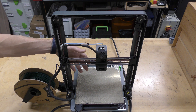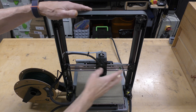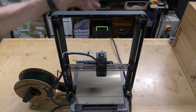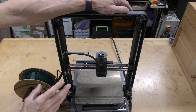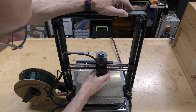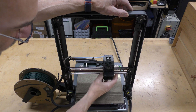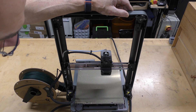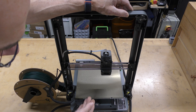You may have noticed there are no wheels on the back at all — they're using linear rods for the Z-axis. This is what they call a Core XZ machine. There are two motors using belts that move the X back and forth and the Z up and down. There's a separate motor for the Y-axis, so it's obviously a bed slinger. This machine is really fast.